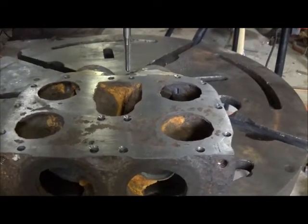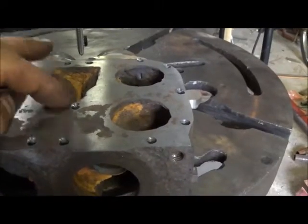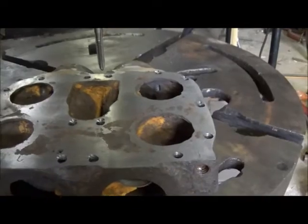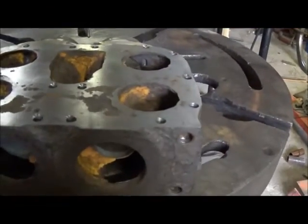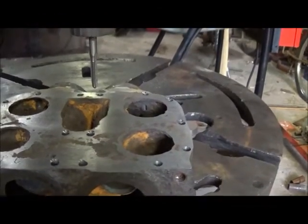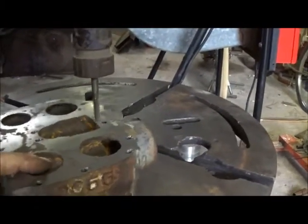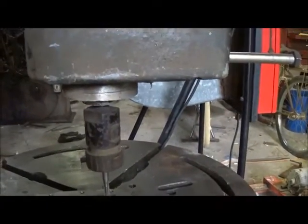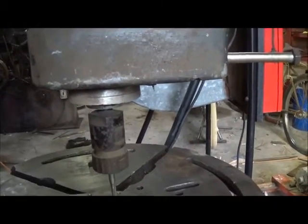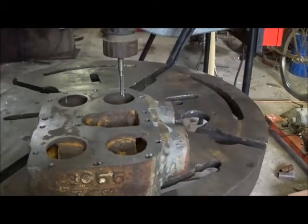We're making some headway on this thing. I got all the holes drilled and ready to tap. I only had one clamp on it when I had my plate up there and it slid a little bit - I actually marked it with a drill bit in a cordless drill and got a couple marks off - but I luckily caught it and was able to move it before I actually drilled it, so we're okay. What we're going to do: I've got a Jarvis tapping head here, got it on my old camelback drill press, and we're going to go ahead and tap the holes. I've tapped three of them already. Some of you may not have seen one of these work before, but I'll show you. You can actually use this thing in a drill press - even a small one if you run it slow. It takes a number two Morse taper, and this drill here is number four, so I've got it adapted down with an adapter. Does a good job. I'll turn it on and let you see it do a hole or two.